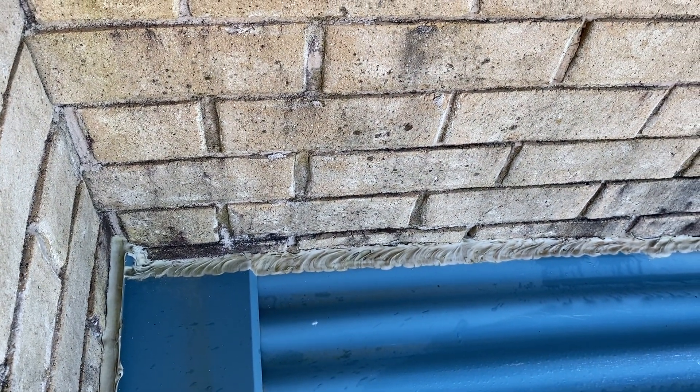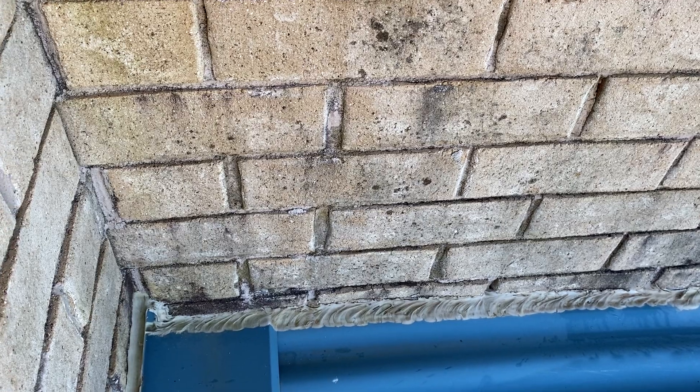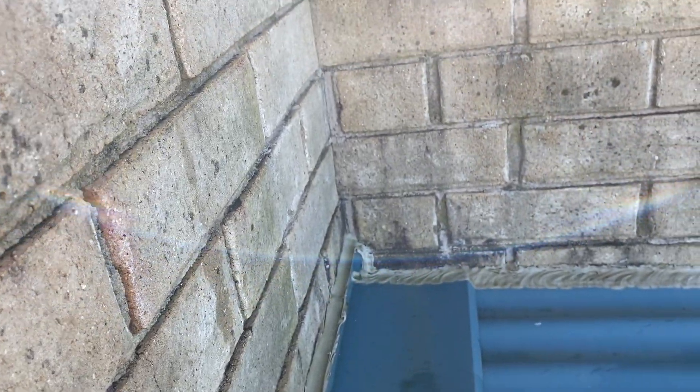There's no adequate flashing or seal to the roof above the balcony below. There are also gaps to the perp ends of the brickwork that need re-pointing directly above the leak. There are gaps to all this brickwork from wind erosion and the flashing looks like it needs resealing.